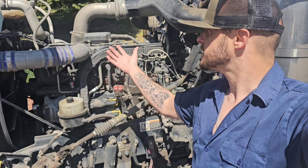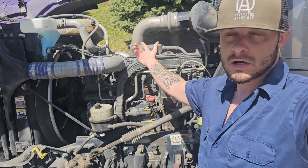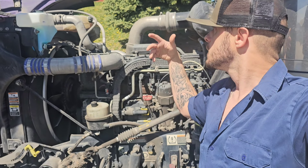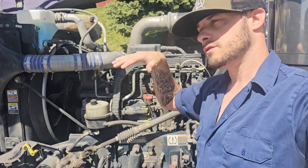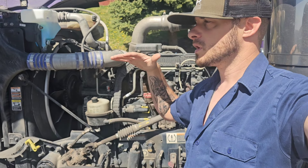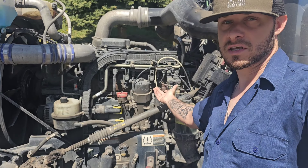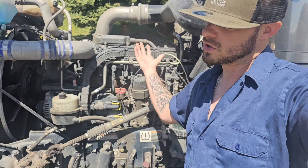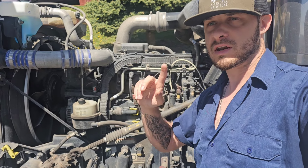The other day I noticed my coolant reservoir, my expansion tank — coolant's red but there's a bunch of white foam on the top. That's what happens when water and coolant mix with oil — it turns white. Luckily I didn't see any on the dipstick, so it's probably not horrible, but there are a few things it could be.